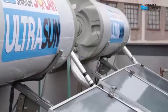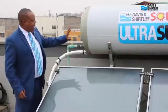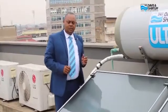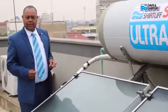One is what we call the tank. The tank holds the cold water and also holds the hot water after it's heated. The tank has three components: the outer casing that holds the insulation in place, 40mm insulation, and a stainless steel tank that holds the water — stainless steel so that the tank will not corrode.